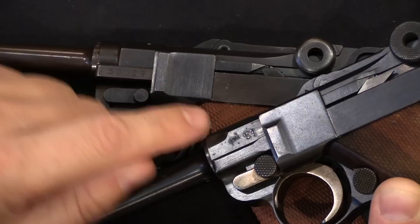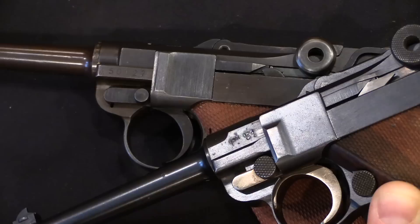Little things they were able to do to reduce machining time for the guns. They also simplified the machining on the side plate just a little bit. Earlier production guns had cuts on two sides giving a nice little protrusion there. On the 1929 they said it doesn't matter if there's a little extra material — they can just make one machine cut up the side and be done with it.